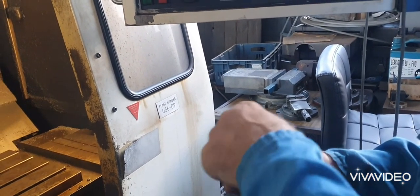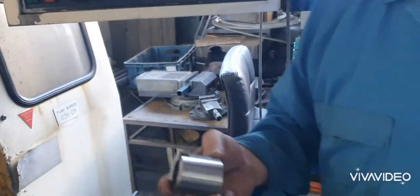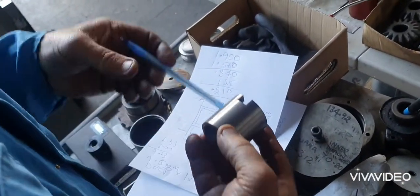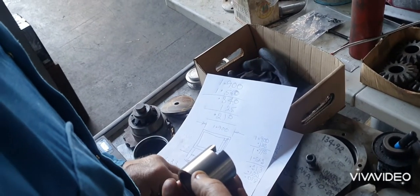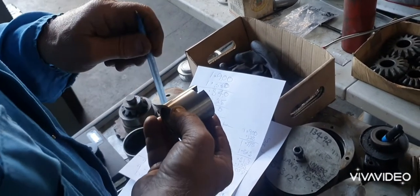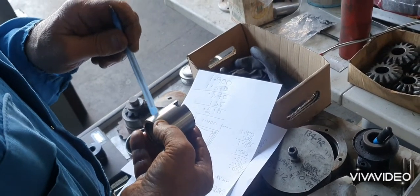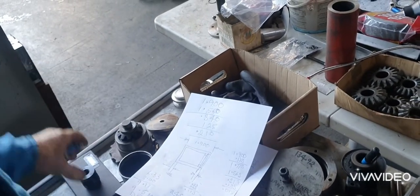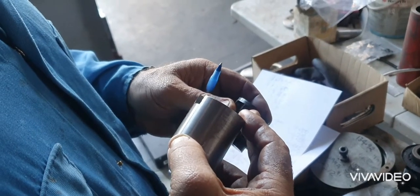that we worked out to arrive at that centre, 20, using that, that was 12 mil, that's right. So the central position, the movement is at 28.6. Using a 12mm end mill, that is, but we added 6, so 12mm go to there, but it can't be 12mm, oh, it's only 3/8 those holes. In this mechanism, it's 3/8.